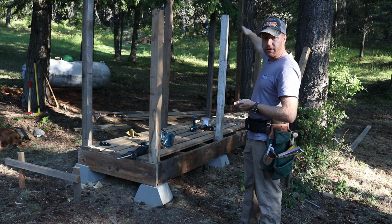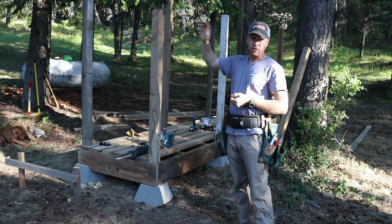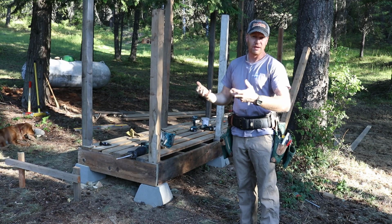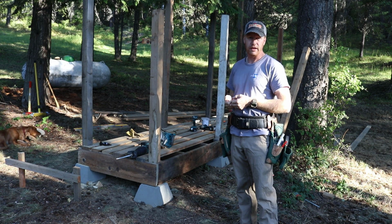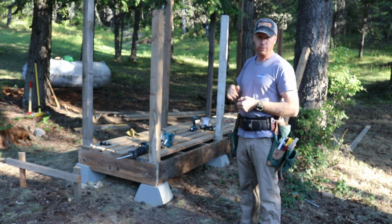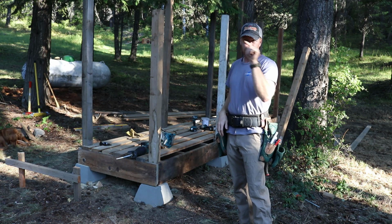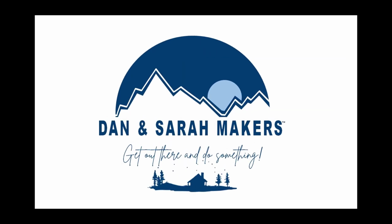We'll have like a delta rib style panel with drip edge around the edge, and then we'll put a J-trim on the sides and the top. That'll just keep snow and things like that from possibly accumulating underneath the metal roofing, and then nothing on the bottom so it can just slide off. We will put some foam closure strip on the bottom so wasps and fun little creatures like that don't get in those little high ribs and build nests. So we'll get after it.